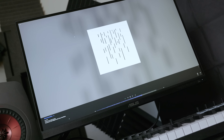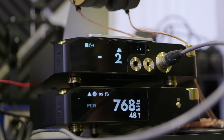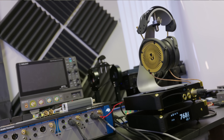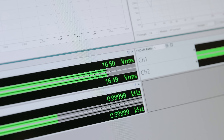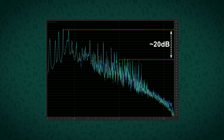I put the Tungsten through a difficult but realistic scenario where I simply listened to a track — Murmuration by Gogo Penguin — and turned it up to the louder end of where I'd usually listen. This gave me an 87 dB A-weighted volume measured at the headphone, and we were at minus 2 dB on the volume control of the amp when feeding it from the Harmony DAC. Then, without changing the volume, I simply played a full-scale sine through the amp to see what is the maximum voltage that at this listening level could actually be coming out of the amp at any frequency. The result was 16 volts. Checking the song itself, we can see it contains content up to about minus half a dB, so at this level it'll cause the amp to output up to 15.1 volts. And looking at an FFT of the song, we can see that the bass content is 20 to 25 dB higher than the higher frequency content when looking at the song as a whole.